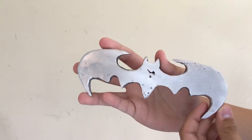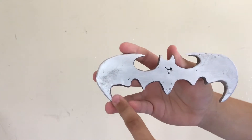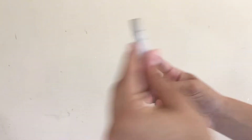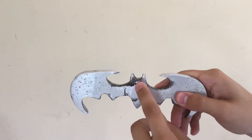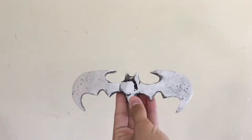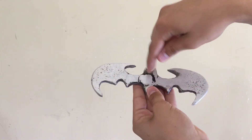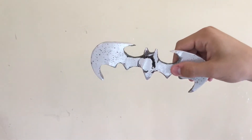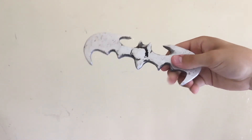I'm pretty much finished making this batarang. I could keep shining it up to make it look prettier, but I'm going to move on to another project that's going to be much better. This side turned out relatively okay — it's got a little bit of a splotch and you can still see some bubbles, but I could probably shine most of that out if I kept sanding it. This other side, however, is just awful — tons of pits and bubbles everywhere, and there's even a hole that goes all the way through. I think that's from where I had the sprue go right onto the foam model and it knocked some sand in there. Every time I've had a sprue go directly onto the foam item, I've had a hole in it, so I'm not going to be doing that anymore.